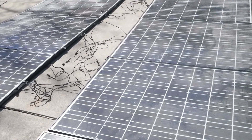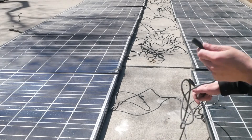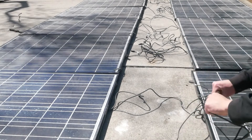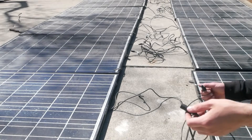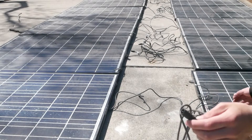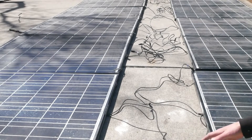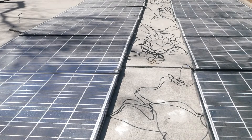I'm going to have to use a lot of protection on this because I'm going to be vaporized if I touch this. Let's unjumble this mess of wires. So each solar panel has a positive and a negative, and we're going to connect them together — just kidding, don't do that. Instead we're going to connect negative to positive of another one. Once you make the first connection you've got to start being really careful because it's not one panel anymore — it's two, three, or as many as you add in series.